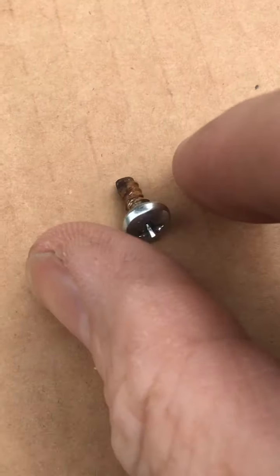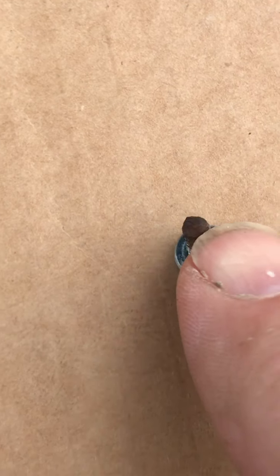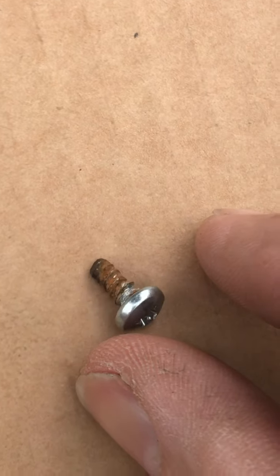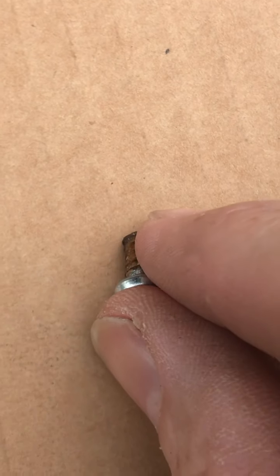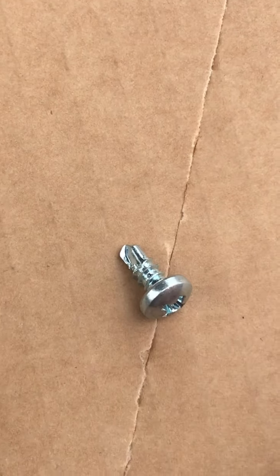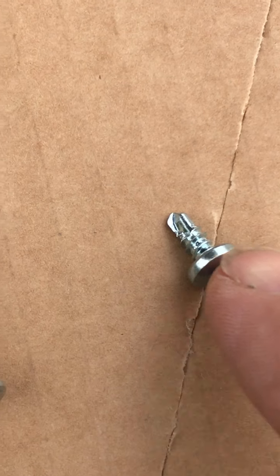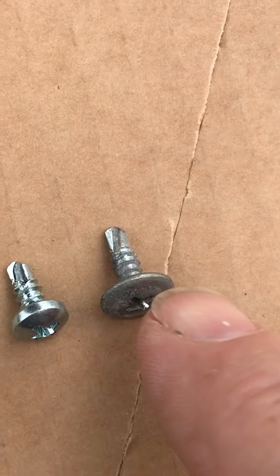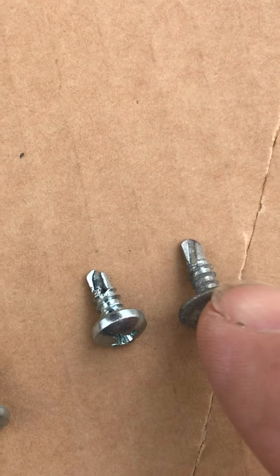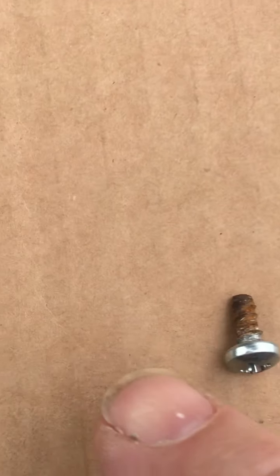Nothing wrong with this hood — and these are wonderful, especially when you chuck them in the skip. Brass. And why did it go wrong? Because back then they were using these screws, and these were not very friendly as self-drilling — in fact they weren't at all, so you kind of had to pre-drill them to get them to work. A lot of complaints. So then they moved to that star, which has got a self-drilling top on it. And as you drive it in, it self-drills. I've always been using that star — large diameter head, self-drilling, used for drywall and plastering — but either one works perfect. But that's the reason why.